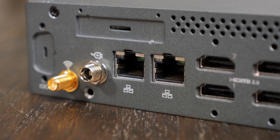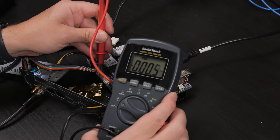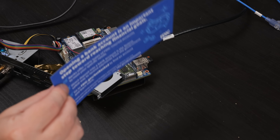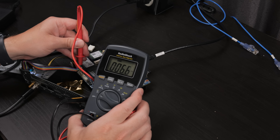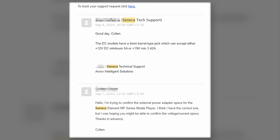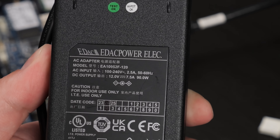I also noticed that the two gigabit NICs aren't the same — one is an Intel i211 and the other is an i219-V. I'm not entirely sure why they're different. With my multimeter, I double-checked the voltage on the SATA power header, and it turns out the two pins on the right were ground and 5V respectively, which mapped to the corresponding wires for the fan, and sure enough it worked — though the noise was a bit annoying. Sadly, my hopes of hooking up 3.5-inch hard drives were crushed when I found there was no 12V pin on that SATA power header. I did reach out to the company that has since bought out Seneca, and they let me know this system works with any 12V or 19V power supply as long as it provides 60W. In the meantime I had already found a 90W 12V power supply that worked just fine.